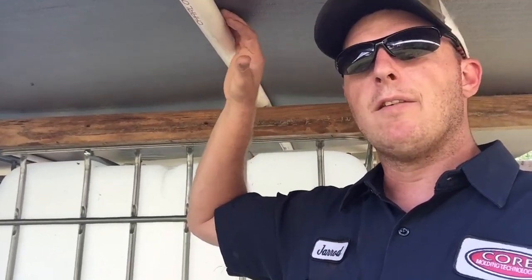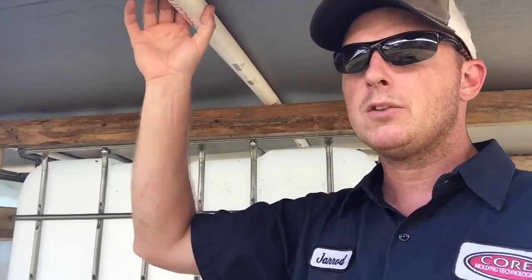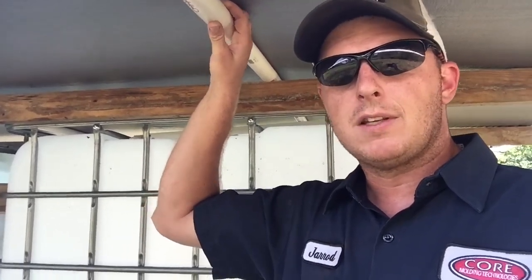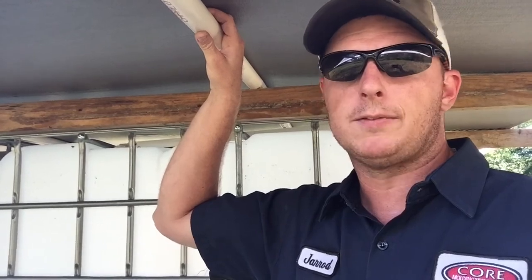So I wanted to have a roof that shed the water really well and didn't have weight on it. And if I put a bunch of bearing weight on this outside post, these PVC are obviously going to snap. So I thought, well, I'll do a PVC and I'll arch it like a greenhouse. Ended up settling on just a flat roof. And Joel Salatin kind of sold me on that idea, because he said anywhere you park, it's not going to be perfectly level, so the water will run off.